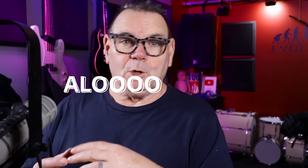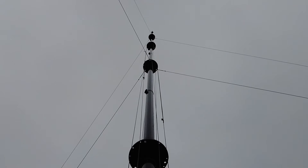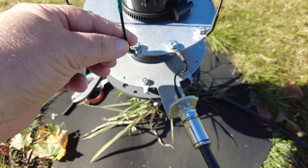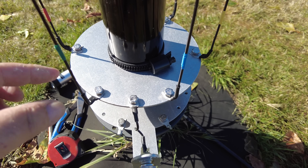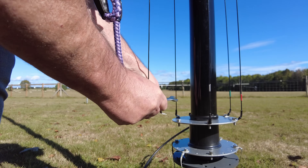Let's keep this real — most antennas are pretty simple. We've got some coax, wire, alloy, aluminum elements, and somehow we get the best SWR. A DX Commander is no different. It's just a ground-mounted HF vertical multiband antenna based around a fiberglass pole and several quarter-wave wires arranged around it in a circle, all fed from the base with an SO-239. The concept is simple, it's well-understood RF, and it works.